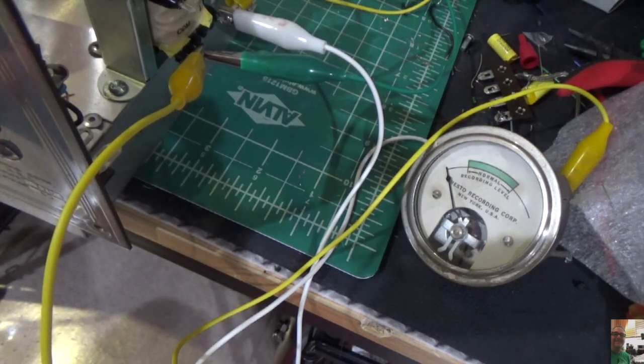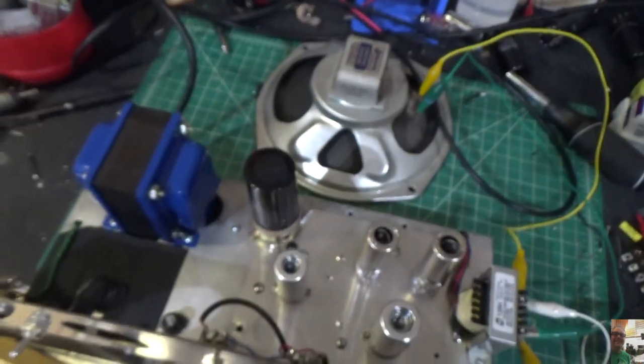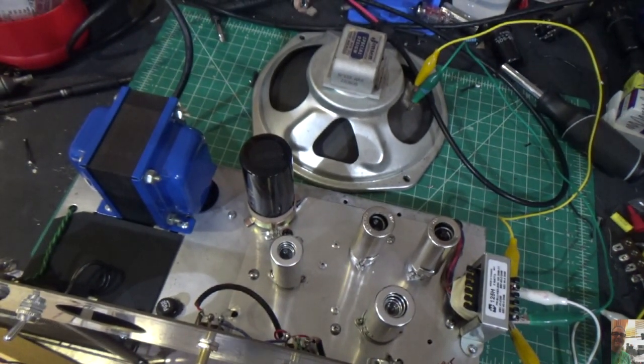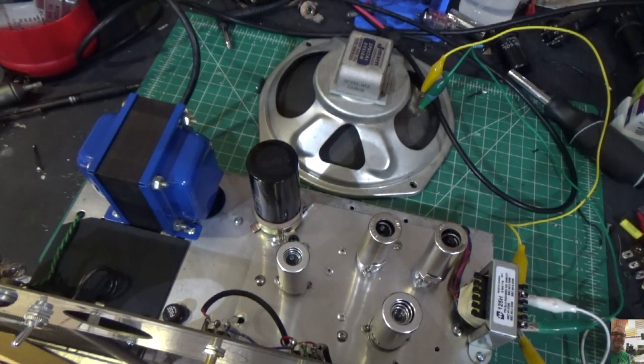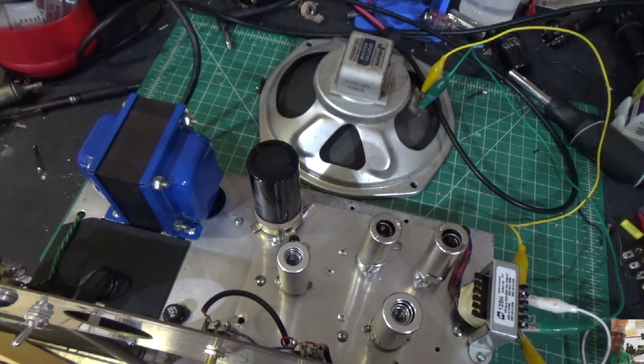So let's turn the amp off. In the next episode I'm going to put this thing up on my scope and my dummy load box — this video is getting a little bit long — and I'll show you what the signal looks like. Then I'm going to show you what cabinet I'm going to mount it in. But this amp is in good shape, and this is proof that when you build an amp, lead dress is extremely important. Having wires running all over the place gives you squeal and all kinds of stuff. So we're in much better shape.